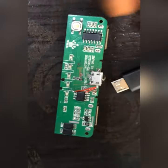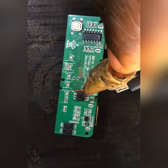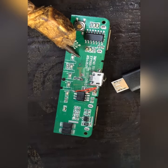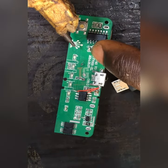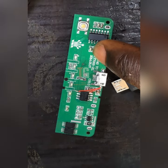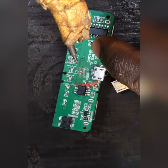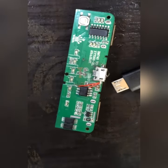What I did is: the 5 volts that is on these legs going to this charging IC — I passed the 5 volts to this side. You can see the tracks of the battery connector — this is the tracks of the battery connector, and it's going to the IC. But what the IC is producing to the battery — that output is supplying very very low voltage, about 1.2 volts, which is very low. So I've bypassed the 5 volts to this side.